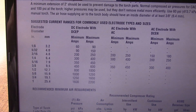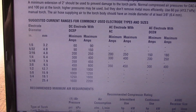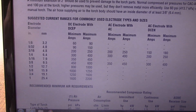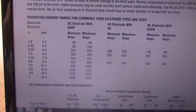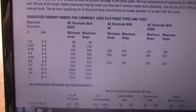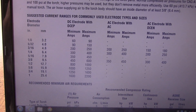This is a chart for carbon arc gouging that gives you the diameters of the electrodes versus the amperage that you're going to want to run. You can see that we're running an eighth-inch, so we want to be between 60 and 90 amps — I'm probably going to go right on the high end with 90. This gives you a reference if you have a different size; you can line it up and figure out what amperage you need.